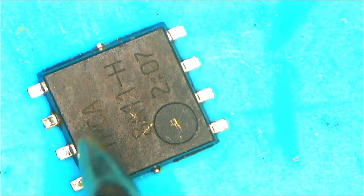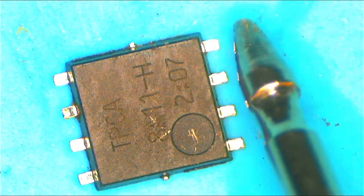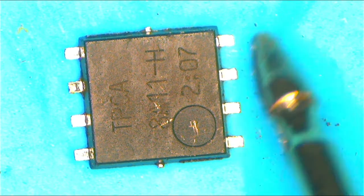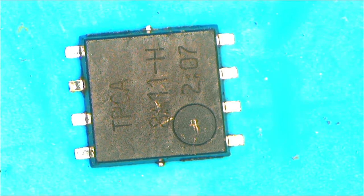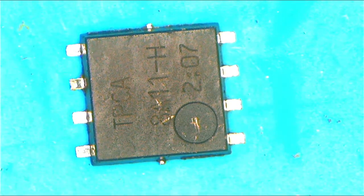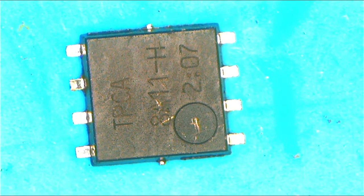These three pins are not connected with the gate. If you use a multimeter you'll see there is no continuity from those pins to the fourth pin — no continuity at all. But if the MOSFET is dead, there will be continuity — the gate, source, and drain will all be connected if the MOSFET is shorted or dead.